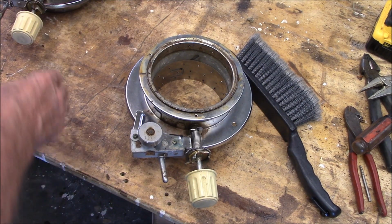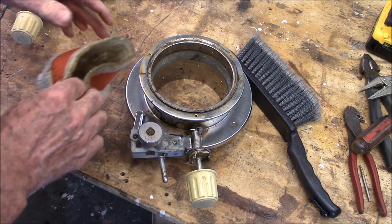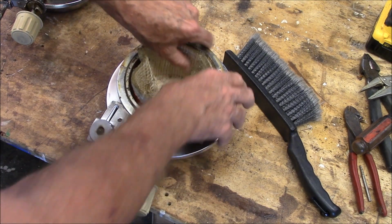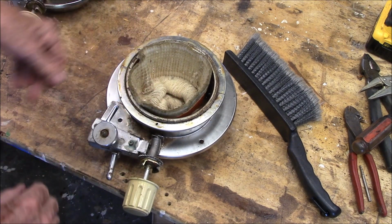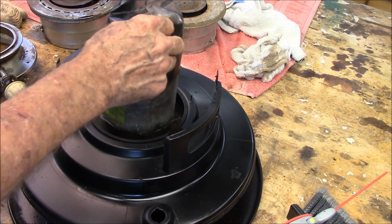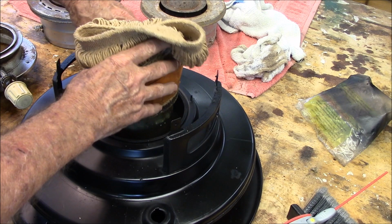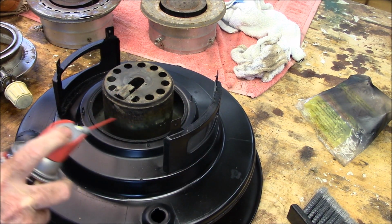And when you install these wicks, how it works is the wick goes in here, and we'll do this later, but it goes in here like this, and you press it into the sides of the wick mechanism, and then it slides over the little combustion tower. I painted this thing, I was really careful. I put this plastic bag over this combustion chamber here, because that combustion chamber has to be smooth or the wick won't slide down over it. So I had to make sure that was clean. I can even put a little oil on it.